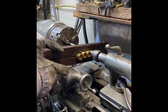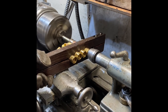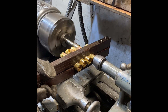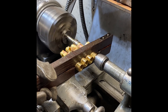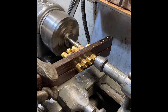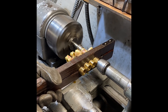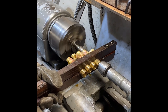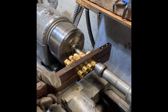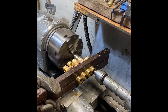You're going to get it over the top of it first, then turn on the machine. Slowly you can feel it cutting as you're going — just want to take your time. You'll feel it as it passes through the knuckles. As soon as it's through, you shut the machine off and you're going to back it off.